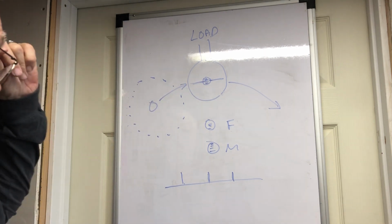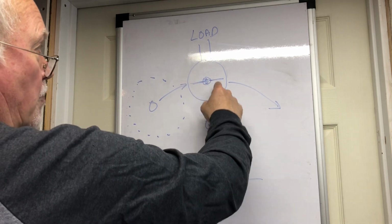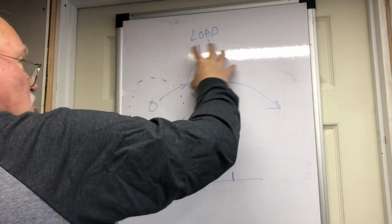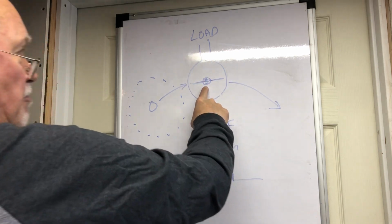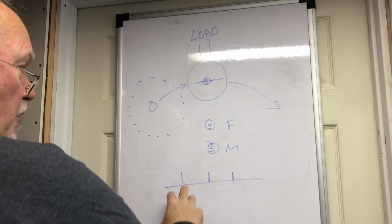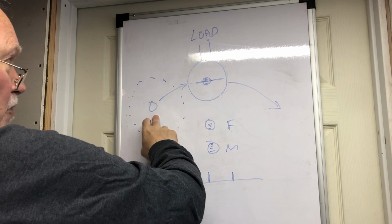if you speed up the rotor. Now, what we have done, because of the way we wind the coils, is increase the capacity of this coil to accept the electricity that's storing up in there, which has to store up to a certain point before it turns this into an electromagnet. So all we have done by the way that we wind the coils is slow down the three-step process long enough to help this get to here without having to change the speed of the rotor.